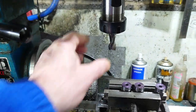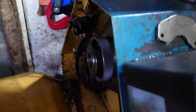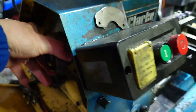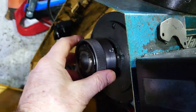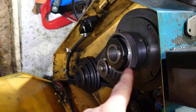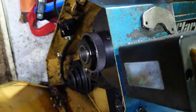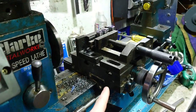The way I've got it set up at the moment, this is free to move and this is in gear. Opening it up here — on your lathes it's possibly a plastic bit, but I replaced mine with metal. Basically, facing back, it drives your lathe's head, and if you push it forwards it then drives the other position. It's a very basic dog clutch held by a ball on a detent — that's all it is.